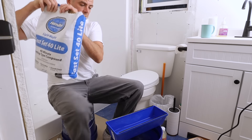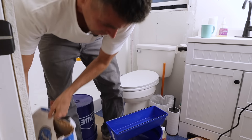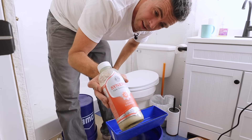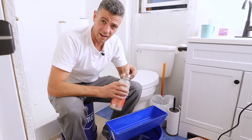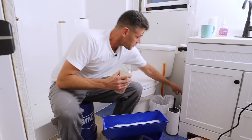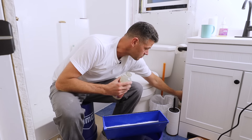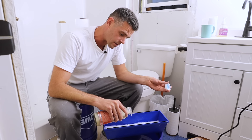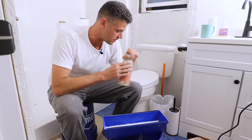Time to start pre-filling and I'm going to be using some 40-minute to try and speed the job up a little. I'm just using Titebond — it can be any sort of carpenter's glue — and it's thinned down. I add a little bit here because I have a glossy paint that I'm going on to and I want to make sure that it sticks.